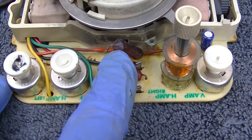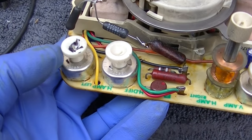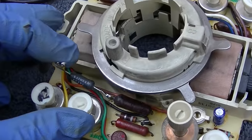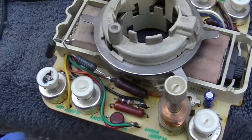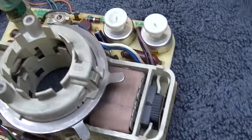I'm tempted to just put a fixed resistor here because finding a replacement that will mount in these holes is going to be difficult. What I've done is lifted the capacitor out that connected to this bad control — assuming it's bad — and put two 33 ohm resistors in series there. This is sort of temporary for testing, but if it looks good I might just leave it. These are three-watt one-percent resistors so they should hold their value. But see how it looks weird — it just lost it.